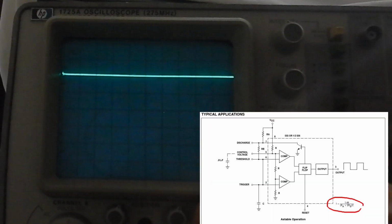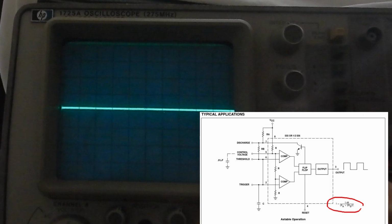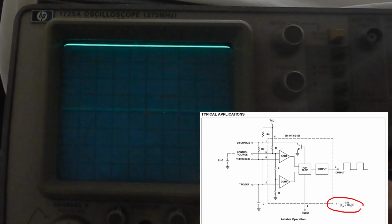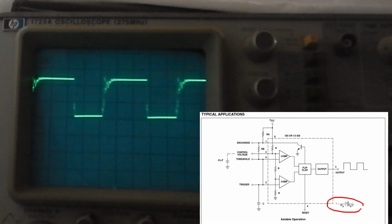This is the output of IC50, which is the last oscillator in the chain, and as we can see it's pulsating exactly as the audio noise. Here we see the output of IC51, which is in the middle of the chain. This should give a square wave toggling at about 1 second interval, and I think it is okay. And going back, this is the output of IC44, and this has a quite dirty edge, and it's also oscillating too fast for the component values in this schematic.